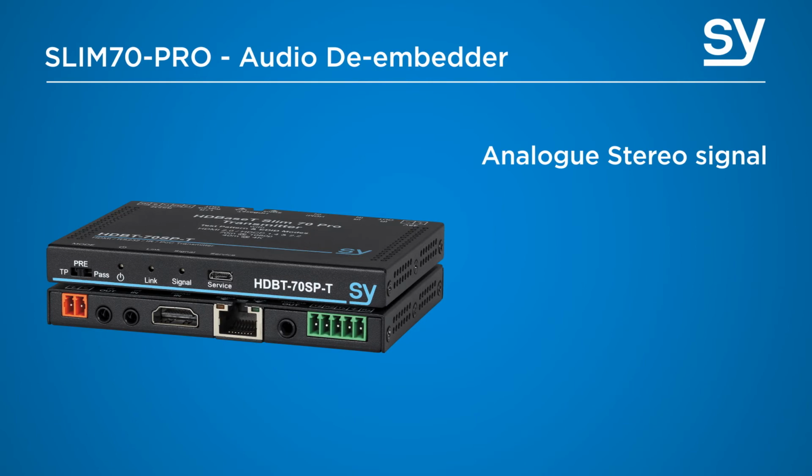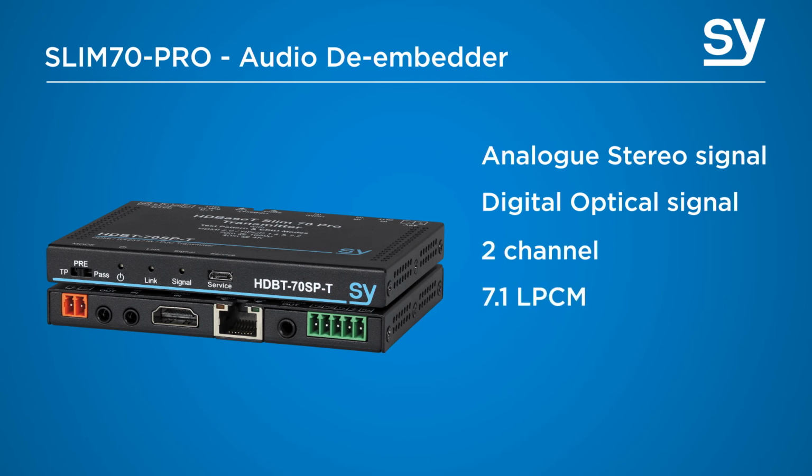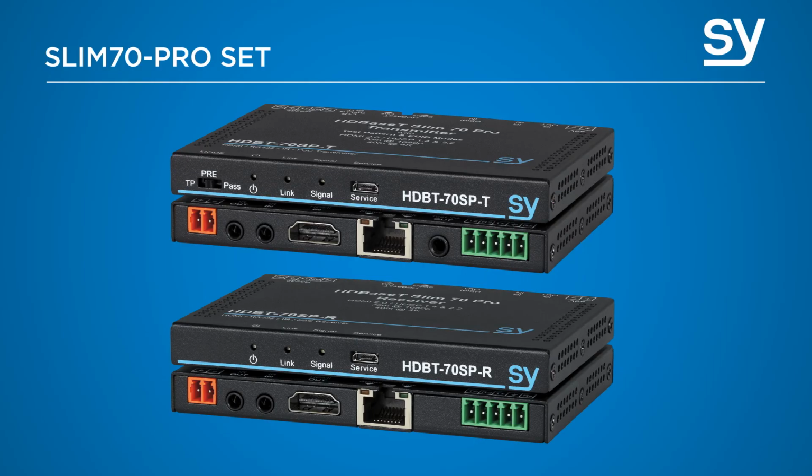Yes, the unit provides de-embedded audio as either an analog stereo signal or as a digital optical signal, including 2-channel, 7.1 LPCM, Dolby Digital and DTS formats. We can see that we have multiple advantages offered to us by choosing the SLIM70-PRO HDBaseT extender, the most advanced HDBaseT extender currently on the market.